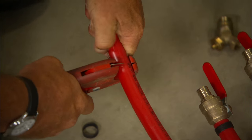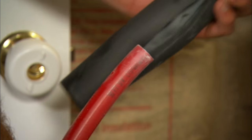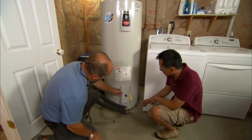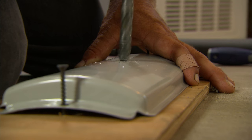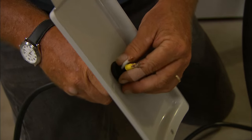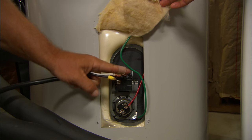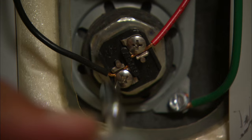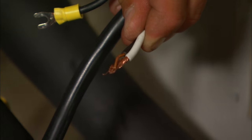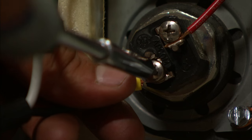To run the water to and from the heat pump, we're going to use plastic piping called PEX. In the front cover that sits here normally, I've drilled a hole and installed a strain relief. That's the perfect place for us to run this wire. This wire is going to run between the heat pump and the water heater right to this thermostat — it's going to bypass this element, so when the thermostat calls, it'll now bring on the heat pump. I'll make one connection with a wire nut, and for the other, I'll just tighten up a screw on this metal fork.